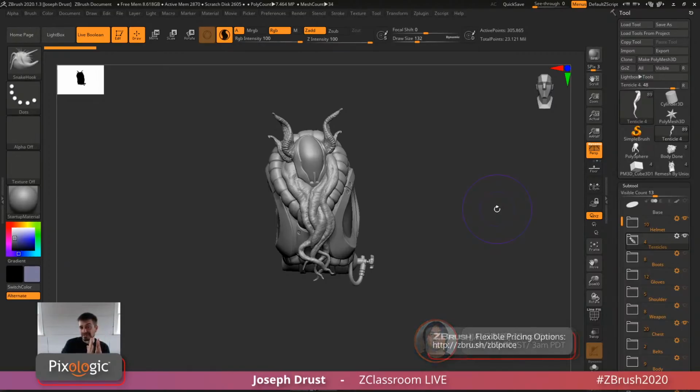And so if you set your thickness initially to say 2 millimeters, and then you decide to change your part scale up or down, those walls aren't going to be 2 millimeters anymore. So definitely yes, I would size the mesh before I sent it for SLA printing or did the hollowing.